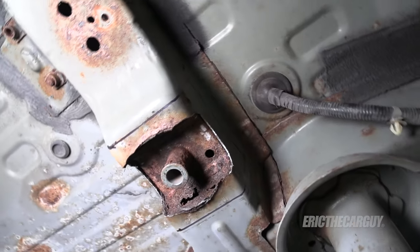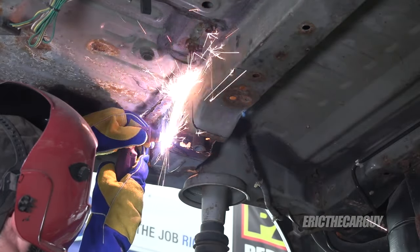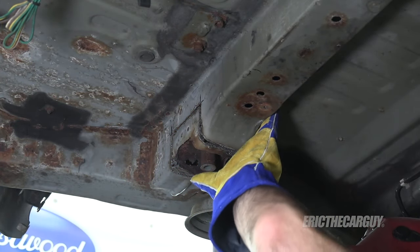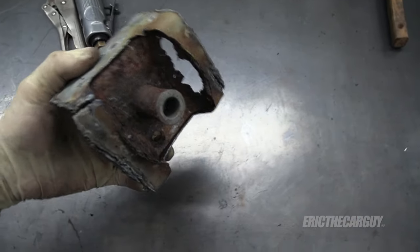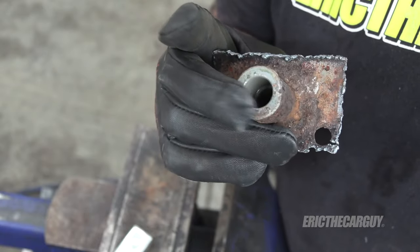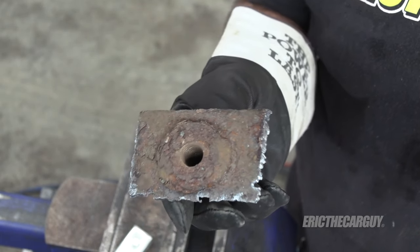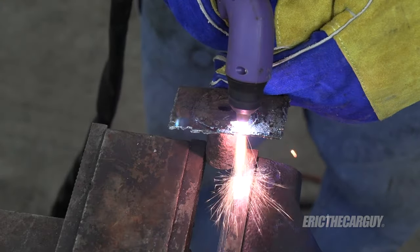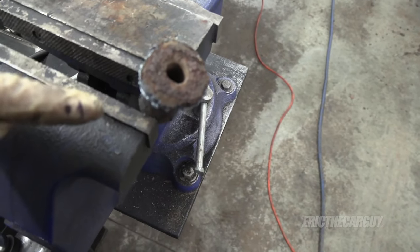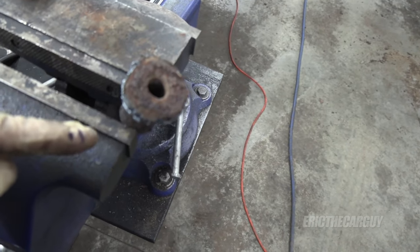The area I intend to remove has been marked off on both sides. Here's the piece I cut out — it's still a little warm. I'm going to have to harvest this and start over from scratch. It has a big boss on the back of it, which is nice. It looks like it was welded on, and I'm hoping to duplicate the same thing. Here's what I'm left with. I'm going to clean this up, round it off, and flatten out this base because it's going to go through the next piece of metal and get welded to it — similar to what it was, but sitting up a little higher.